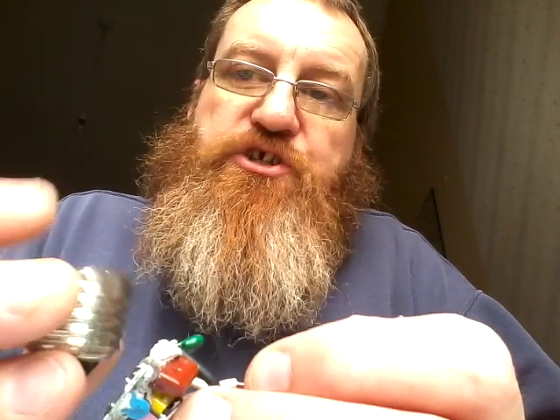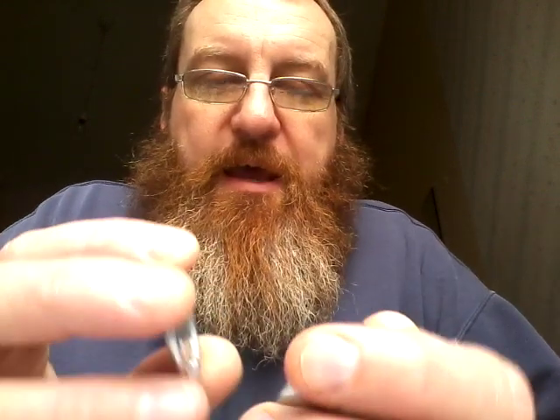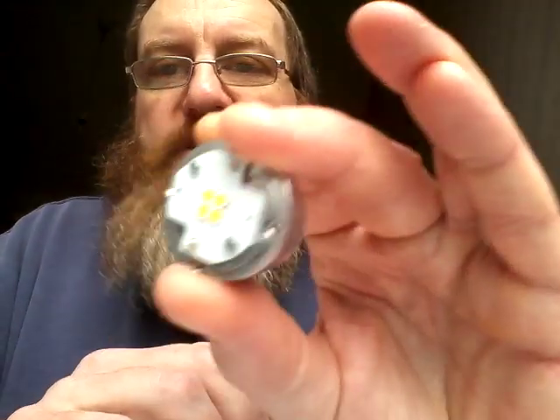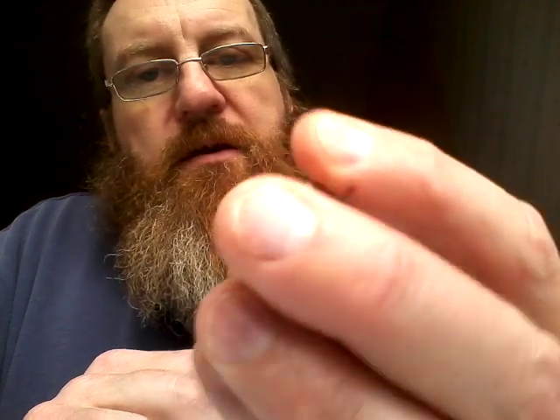In use, they don't get too hot, which is quite nice. They seem to be designed to couple some of the heat into the shell of the socket they're put in, which is reasonable enough given that tungsten lamps certainly make that shell hot. I don't see it as unreasonable to dissipate some of the LED lamp's heat into it, although it is kind of unpredictable depending on the type of socket. But I kind of like this — that's why I bought another. It's quite a smart little assembly, seemingly well-engineered with good thermal connection to take the heat into the housing.